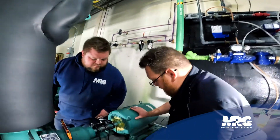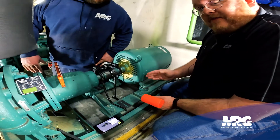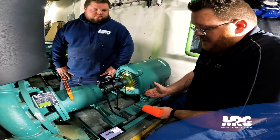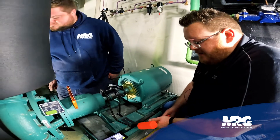Both indicators are at zero, so at this point you want to lock this down. Tighten in a cross pattern — do it three times over: first pass get it snug, go across the diagonal, hit the front, then the back — that's your first pass. Second time through again, and on the final pass lock it down completely. At that point you want to recheck your alignment and see how close you got. Thanks so much for joining us on Mechanical Pros — that was how to do pump alignment on a base mount pump with dial indicators. Hit like, subscribe, and we'll check out next time.